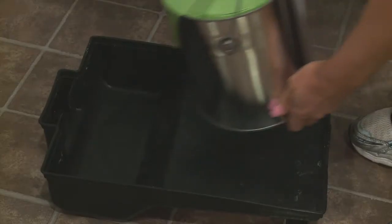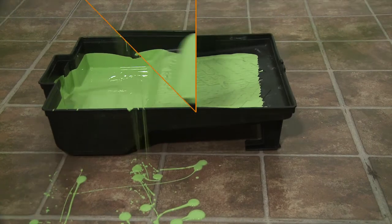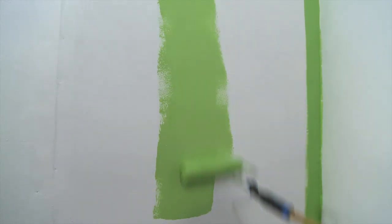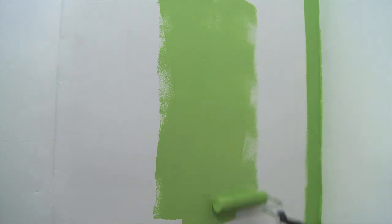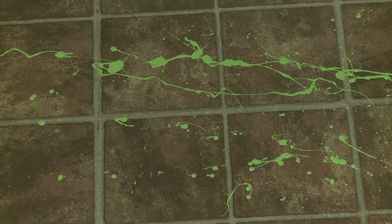Assemble your roller and fill the well of your tray with your desired color. Push your roller all the way into the well to make sure the paint gets deep inside, then roll it off into the tray a few times so that you don't make a mess. Put your fully loaded roller about midway on the wall, about three strokes back from where you want to end. Using big swooping strokes, move your roller along the wall, making sure you overlap your previous work. For a cleaner finish, put more pressure on the arm side of the roller. If you move the roller too fast, it'll splatter all over the place.